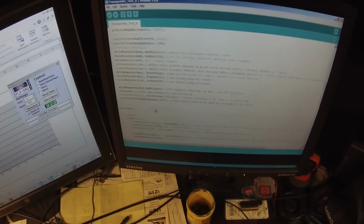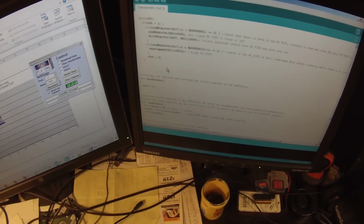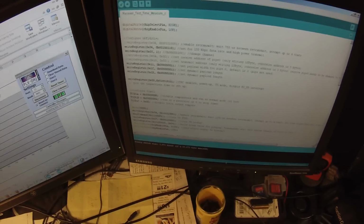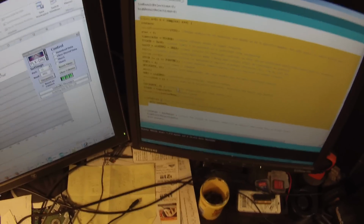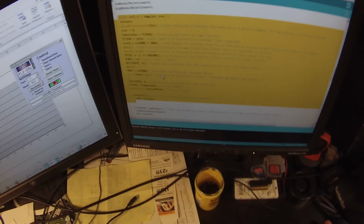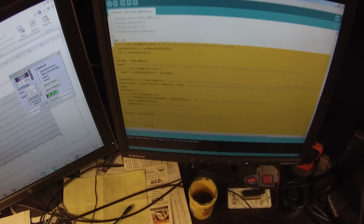So what we've got is a basic code. And all we're doing is initializing the transceiver, sending it some initial data. Actually, this is the transponder. Wrong one. Receiver. So initializing, setting up the timer. And then in this section of code, it's just hammer the crap out of it. About as fast as we can, we're doing about a 1 millisecond delay in between each sample. But we're looking for at least 500 samples or so to get some decent data. And then once that's done, we take that array that we dumped all the results into and perform some standard deviation measurements and then averaging.